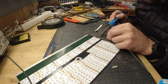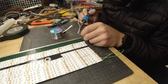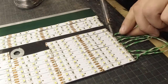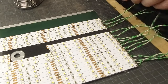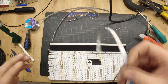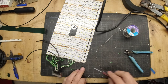Pre-soldering the ends because that's where all the wires are going to be attached. I'm basically using ethernet wire picked from a normal Cat5 cable that I found. They will work really well for this scenario — it's not that much current per strip, so the wire thickness is not a problem. Making sure that I get the positive and negative to the correct ends. I'm twisting them together and using a quick connector for this purpose, then adding the last couple of LED strips and soldering the ends neatly.